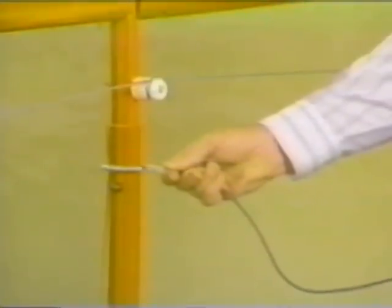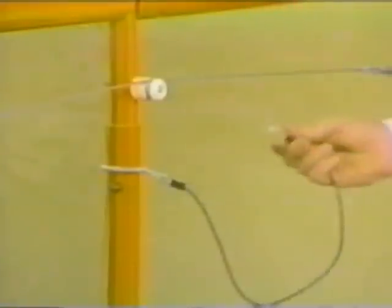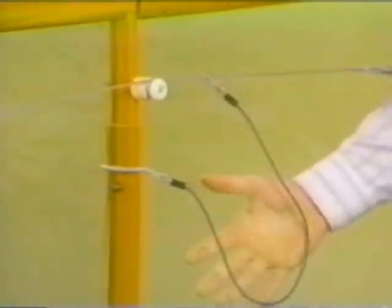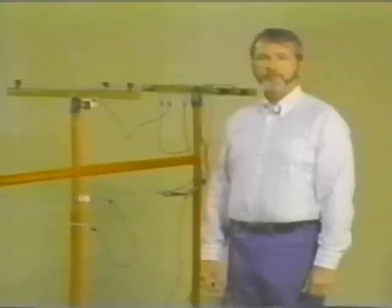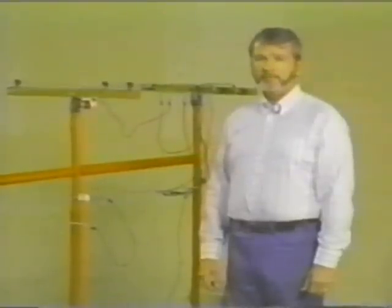The only way that you can adequately protect yourself with temporary grounding is by incorporating into your grounding program the concept of equalized potential, which can be accomplished by use of the pole-mounted grounding cluster with a lead to the neutral, which is sometimes called the personal protective ground. I hope that this presentation has helped you to understand the concept of and appreciate the need for equipotential grounding.